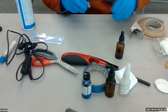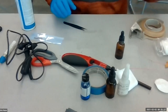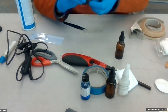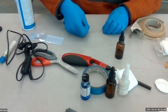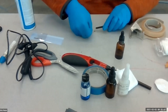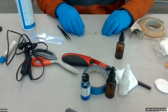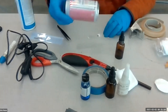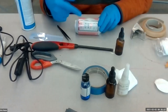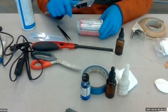I'm going to start out by taking a piece of tape, setting it down with the sticky side facing up. I'm going to take one of these little strain gauges and place it upside down onto the tape. Now I'm going to put it onto our can - remember we're going to do a hoop attachment. So let's get our calipers out and do measurements on this. Get out your pencil and paper and write these numbers down. I've zeroed my calipers, let's get the radius on this.